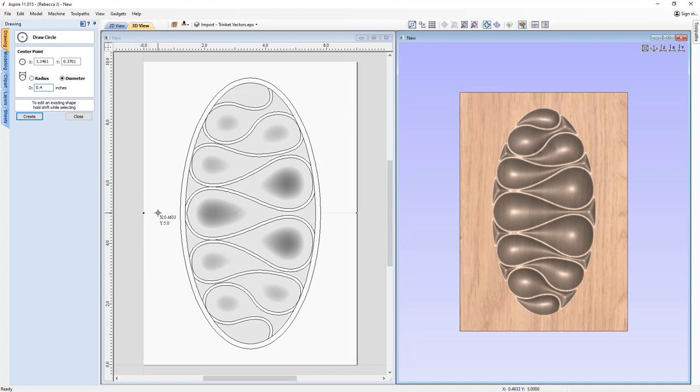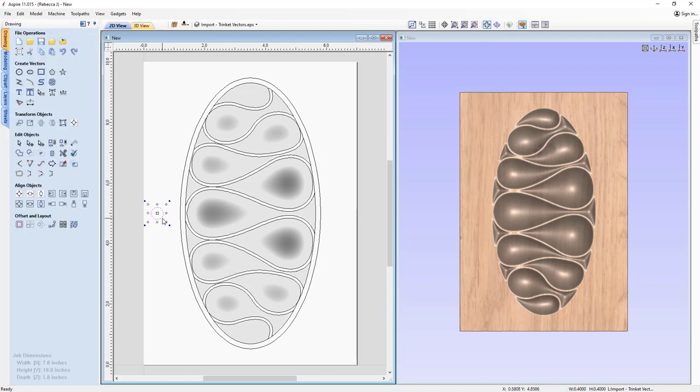And then you could set that up so it's in the center of your material, like so. And then we can close out, and then what we could do is take that and press Control Shift 8 to flip that horizontally. And then you've got two pins there. Ultimately, we're going to cut pockets into those dowel holes so that our dowels can slot into that.